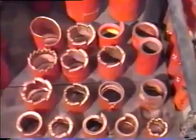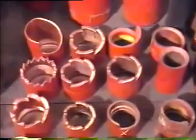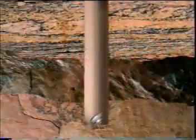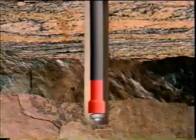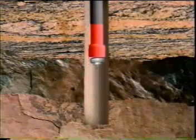Magnets are furnished with flush guides, lip guides, or mill guides, which help in washing and securing the junk. The magnet is lowered to the well bottom while circulating and then pulled to the surface. This activity may be repeated until the wellbore is cleared of all junk.